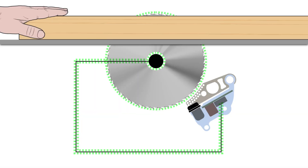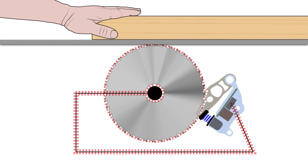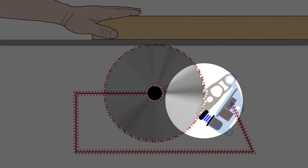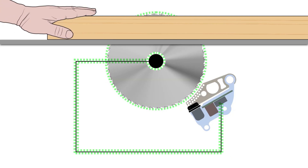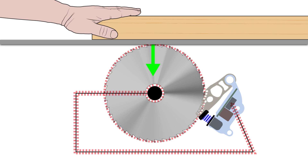Here's a quick review of how the safety system works. If a conductive material touches the blade, the system detects a reduction in signal and activates the brake. In addition to the brake cartridge stopping the spinning blade, another feature of the safety system is that the retraction mechanism pulls the blade below the table.